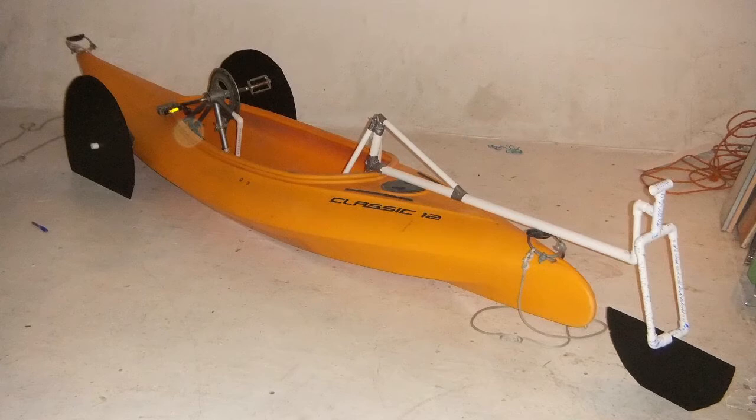Here is the completed full-size mock-up model showing the back of the frame and the rear steering mechanism. The rear wheel isn't shown complete — again, just artistic license. The rear steering mechanism will essentially be the front forks of a bicycle cut off and turned backwards. Early on, I realized that the more parts I could find in a bike store or automotive or hardware store, the easier it would be to repair if I wanted to truly use this in extended long-distance rides.